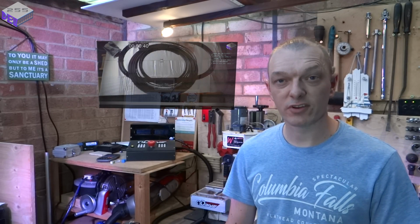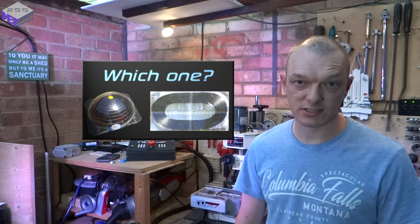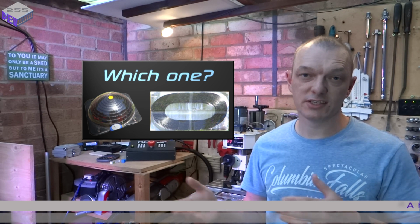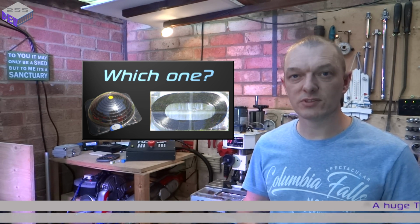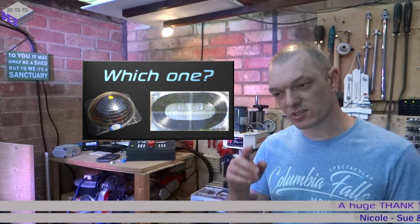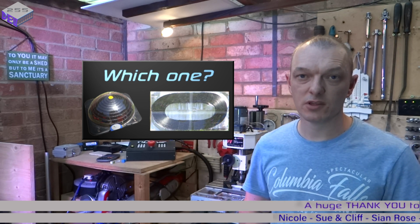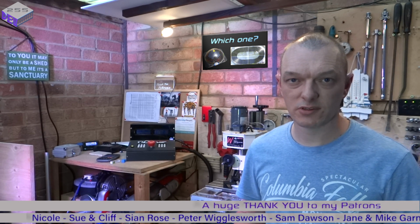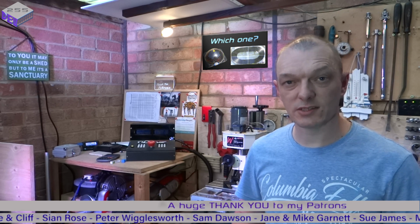So in the last video I made a solar water heater, and in this video I want to compare that panel with one I purchased. So to do this I'm going to measure out the water capacity of each system and then add it to a 10 litre bucket of water so I can cycle that water around the whole system and measure the temperature over an hour and a half.